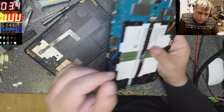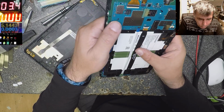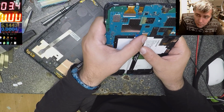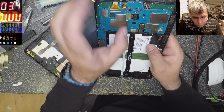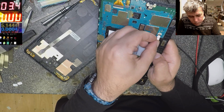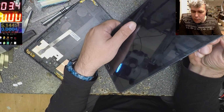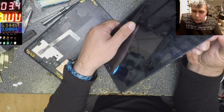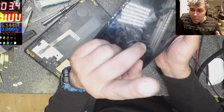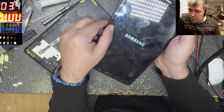Let's take out the battery and check the screen connector. One connection is here. Okay, the cable was a little bit unplugged, so hopefully that's the problem. Okay, battery is plugged. Let's power up now. And it's working fine. You remember we had this issue with the screen cable on the old models, Tab 1, Tab 2, Tab 3, you remember?